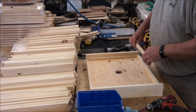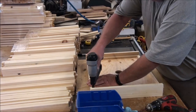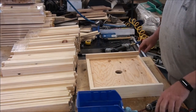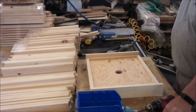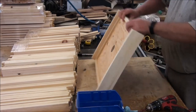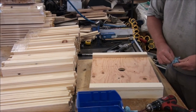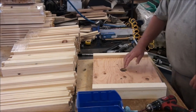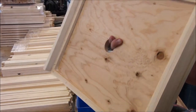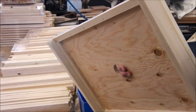The last shim goes right at the edge. I just want to make sure there's not glue on top of the shims, and then double-check this flush side that there's not a bunch of squeeze out. I can just run my finger along it for the top. This other side I'm not concerned about squeeze out — this is the side that will be trimmed, so that can be as messy as possible. This is my nice side, which in the end will be all nicely trimmed.